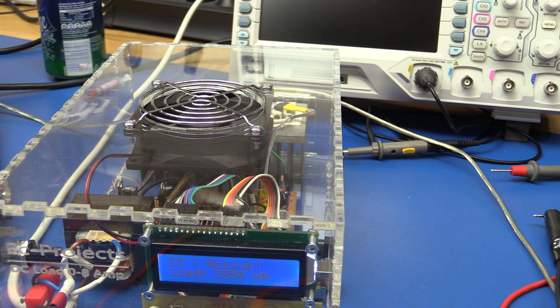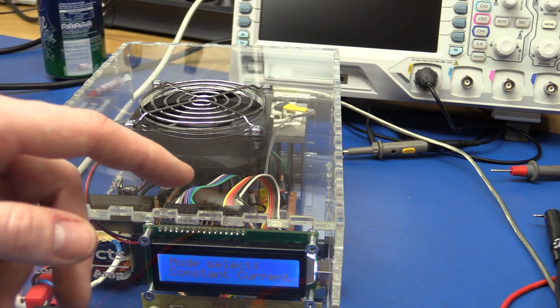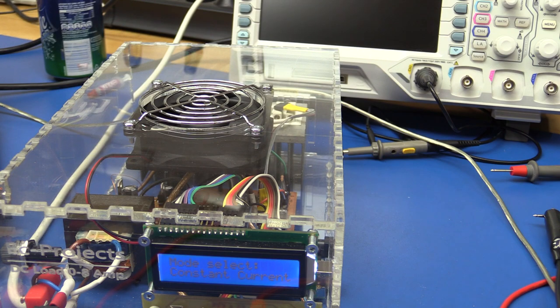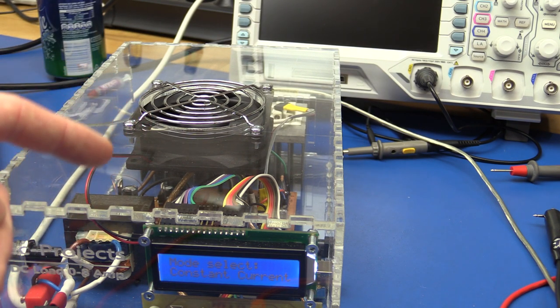And so this is full speed on the fan, so it can get loud, it's just not loud all the time. And there is still a little bug you may be able to hear. Or maybe not. But there is no hysteresis on the fan, so if it, say, toggles between 50 and 51 degrees, the fan will then spin up, spin down, spin up, spin down. But now that you can't hear the PWM frequency, it's not really that annoying.